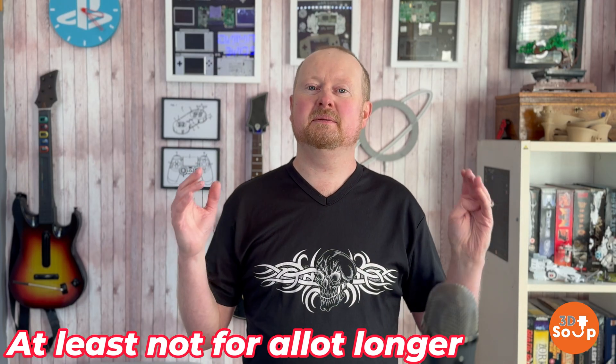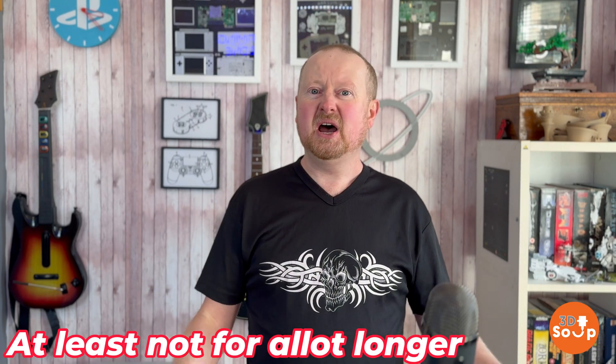But what makes it better than your usual PLA? Well, it's harder to work with — you've got to get your temperatures a little bit hotter, and it does warp a little bit if you don't glue your bed. But it's more durable, stronger, has better impact resistance, and chemically it resists pretty much anything you pour on it more than PLA does. You can also leave it out in the rain and it won't split like PLA eventually does.